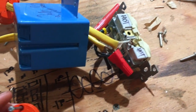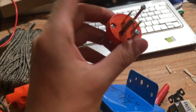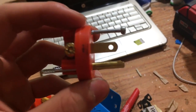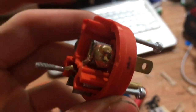First, I want to show you how to wire the plugs. The important thing is knowing which terminal is neutral and which is hot. Some plugs look universal so it's hard to tell. The way you know is by looking at the screws — gold screws mean hot, and silver screws mean neutral.